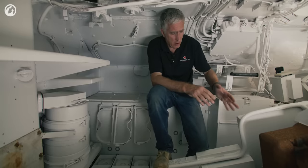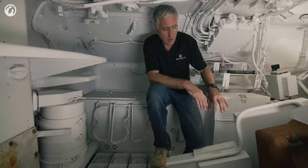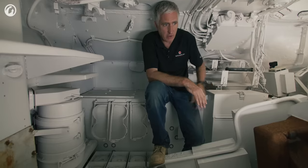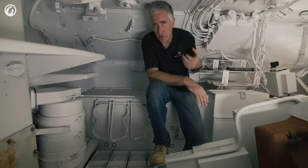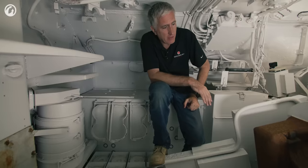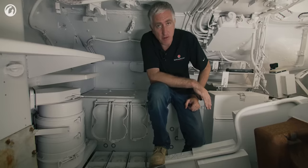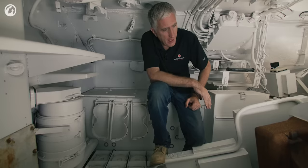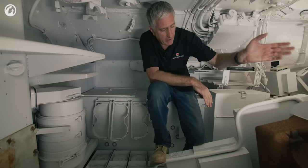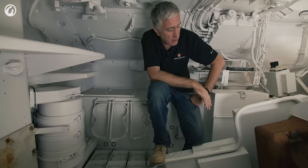The guard is huge. It's made even thicker by ballast to counterbalance the weight of the gun at the front, too, because otherwise the gunner wouldn't be able to actually elevate and depress the gun. The gun itself, looking at the breech, has a vertically sliding breech block. The breech opening handle is on the wrong side. So is the cocking handle. Now look at it. If you have to refire, you pull the cocking handle to try again, percussion primer. Again, separate loading of projectile and propellant.